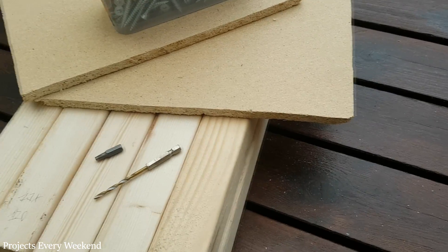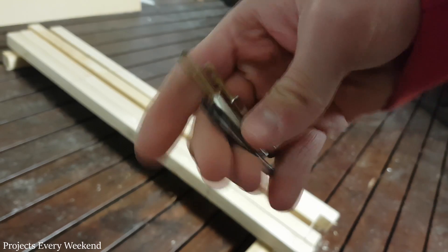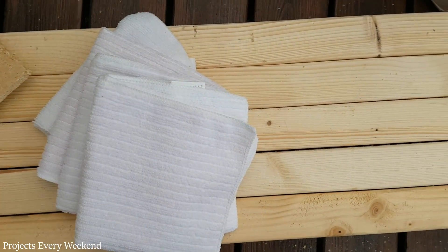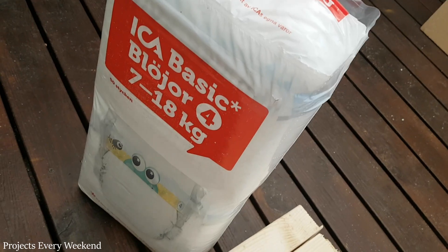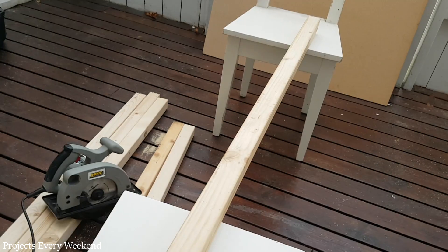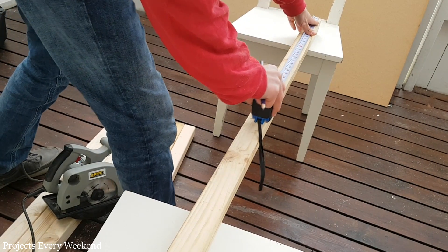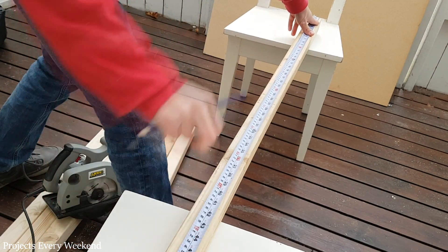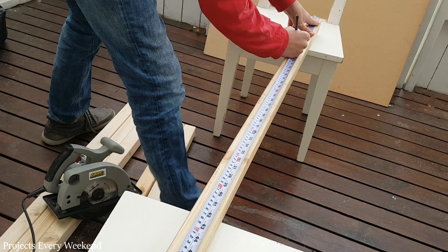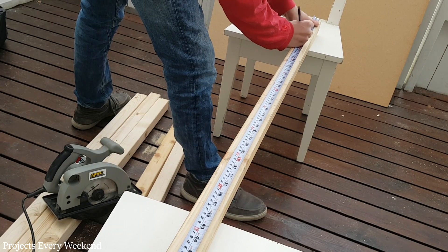You will also need a screw bit for the screws and a drill bit. I ended up breaking 3 of them — now I'm screwed. Last but not least you will need some microfiber cloth and some baby diapers. I'll explain why in a bit. I took the first length and marked out 21cm sections — 21 because the cloth in my case is 30x30cm and the lumber is 4.5cm, times 2 because we have 2 on each side of each cross piece.